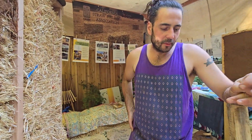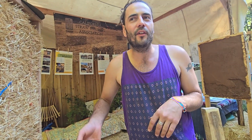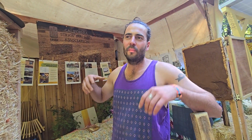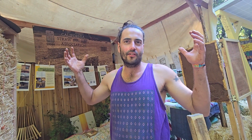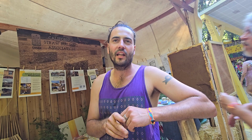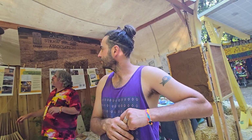They say straw bale homes, like any house, really benefit from having good boots, a good foundation, a good jacket from the plaster, and a good hat, a nice hat to keep the rain off your head. If you have big eaves, which is really popular with straw bales, 3-foot overhangs, so that wind-driven rain doesn't hit your walls, then you can get away with clay plaster if you're in a protected climate. So you have a good foundation, like a concrete foundation or something? Yeah, ideally.